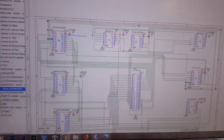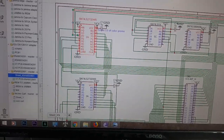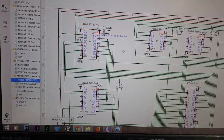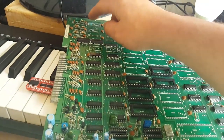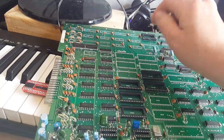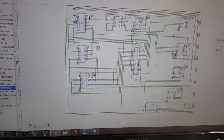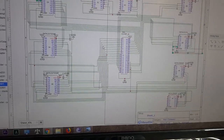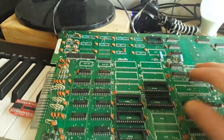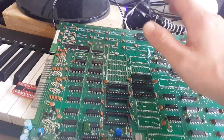It's tedious and long, but obviously necessary — not complicated though. What you do is get a multimeter, apply one end of the probe here, and then either visually follow the trace or, if you can't see it, probe each leg individually. Once you've done that, you should normally have a full circuit for that IC — you've identified where each leg is going in this section of the circuit.